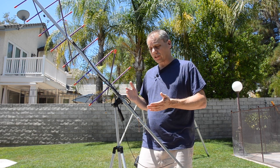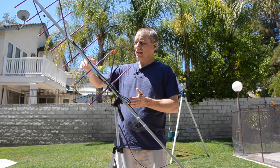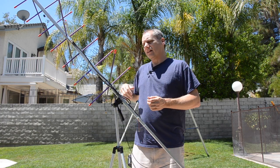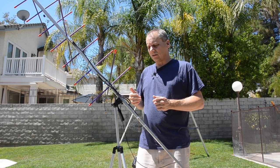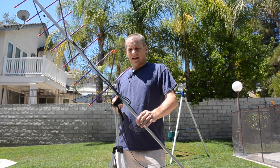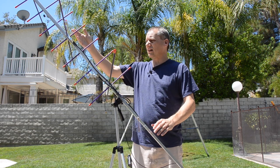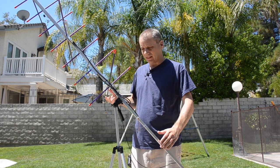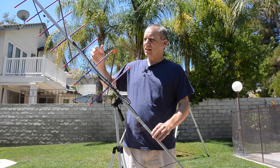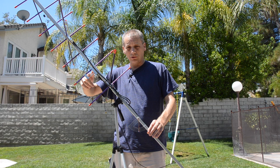There are a few versions of this antenna. This version has a split boom in the middle, but you can also find it as a one-piece. Two other versions exist: with a duplexer and without. The design is all aluminum — all the elements — which makes it very handy and light. The antenna comes pre-tuned and pre-assembled with two gamma matches, one for VHF and one for UHF.